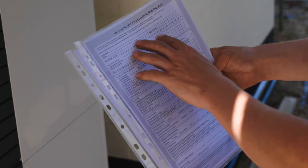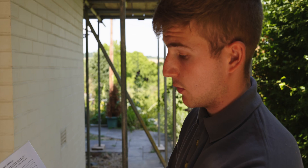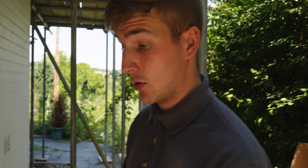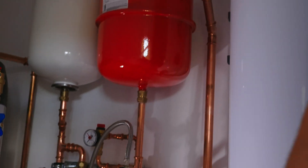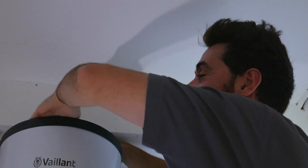So this here is the commission checklist — tomorrow my job is to fill this all out: check flow rates, DTs across the system. I also have the unvented cylinder as well to go through, plus warranties for that. That's my job tomorrow, along with internal lagging, and that'll be us all wrapped up and finished. We're very much nearly there with this one. Annoyingly, we're missing the connector plug for the pump — I'm pretty sure we've got one at the office, so we're going to grab one of those. Liam's back tomorrow just to do the final few bits and the commissioning of the heat pump. But for now, I think it's just hit 31 degrees here, so I'm off to jump in the canal. If you like and subscribe, producer Harrison will show you that video at some point. Cheers, see you in the next one.